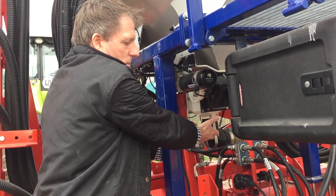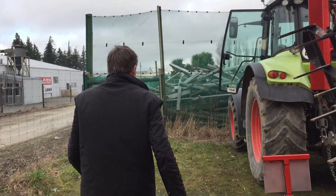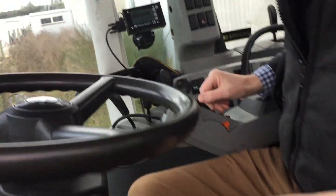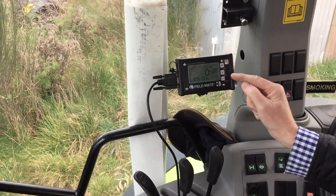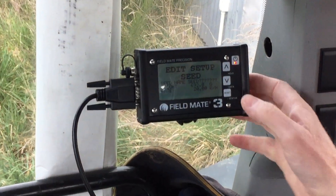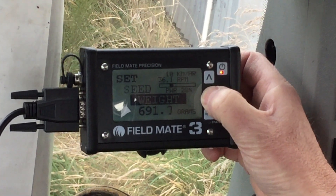Let's assume we've captured our material, weighed it, and got the magic weight. We'll enter it into the monitor — let's say it's 300 grams. Back at the Fieldmate monitor, quick press power to get out of that screen and come up with the up arrow to the main screen. Hold down any arrow key and this is the edit seed screen. We want to enter the weight — we've highlighted weight here, hold down the arrow key. We said we've got 300 grams, so we adjust this number to get 300 grams.